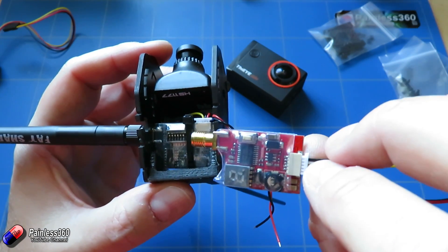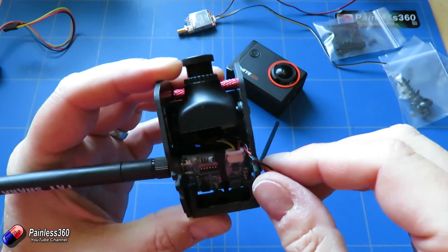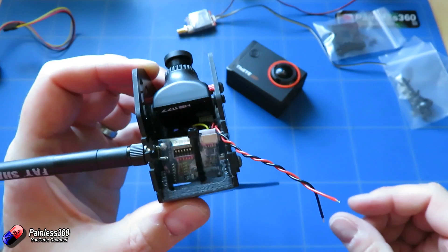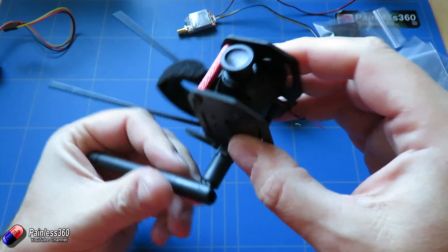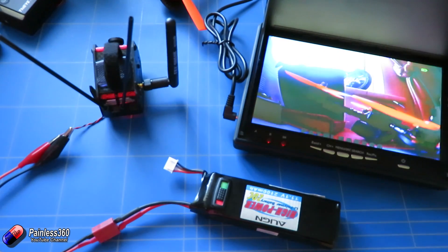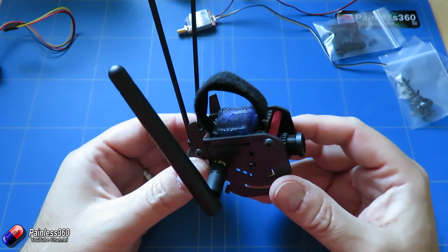The selection of band and frequency on this transmitter isn't on a push button, but the benefit is it doesn't have the connector on this side so it fits nicely. I've connected the cables up exactly as we looked at in that slide — at the moment I've only got these two wires coming off, which are going to connect down to the power distribution board to the plus 5 volts and the ground. With things like this I'd always recommend testing them before you put them together — I use a little rig, put it on a little 3S battery and clip the leads on to power it up. Always do that before you put everything together, because once this little guy goes together — it's like a Swiss watch — it's going to be really painful if it turns out it doesn't work.